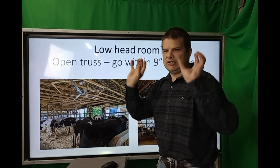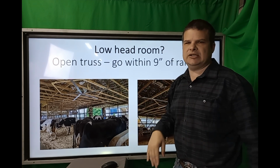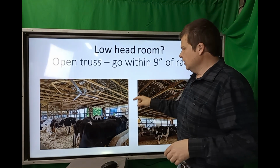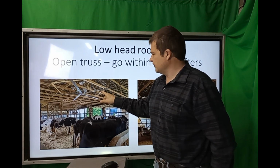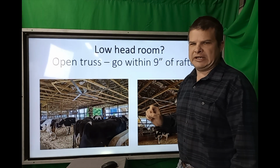So here's our last one, that low profile one, which is a specialty that we do. The fan mounts up against trusses. This is only for open truss buildings. If you have a ceiling in, you need more room for the air to get in. You can't go up tight if you have a ceiling. So it goes up real close to the truss, and we put the bumper guard in, so if the blades ever do flex up, they won't bite in.